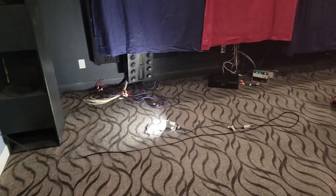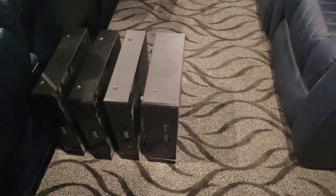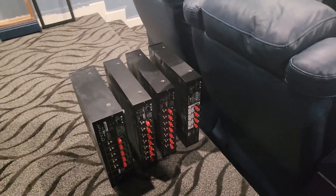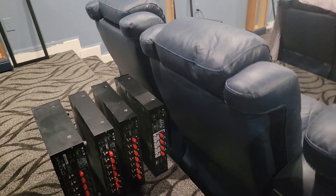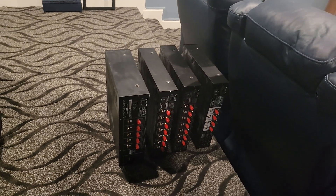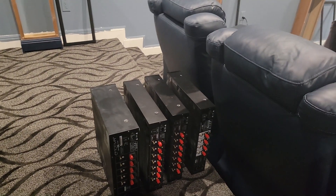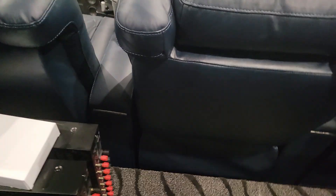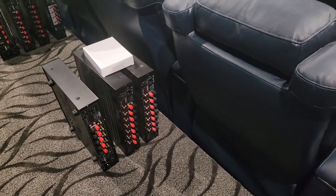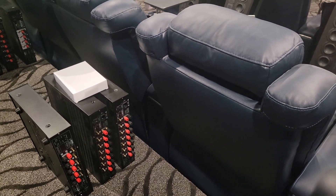The other thing I did is I had all those amplifiers stacked up under there — I pulled all that out because I had dust all over it. So I've got the amplifiers: that's the left channel amplifier. You've got the two seven-channel Bass-X's, then the four-channel which drives the dipole woofers, then a five-channel one which will be for the side speakers and rear speakers with one channel left over. In the center you've got a couple of seven-channel Bass-X's — five channels on each of those will drive the center speaker. That'll leave me a total of four extra channels for maybe Atmos or something.